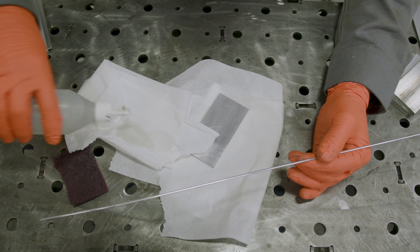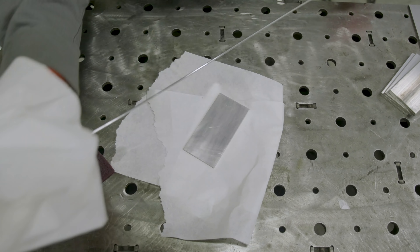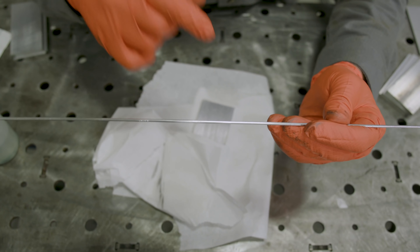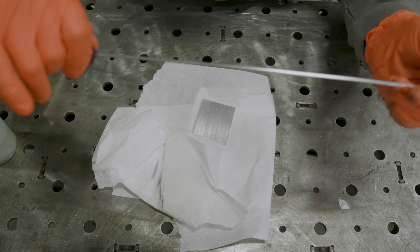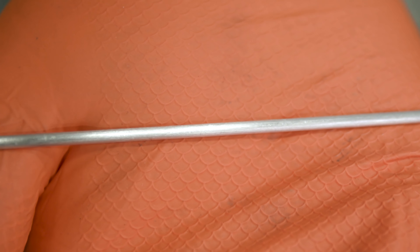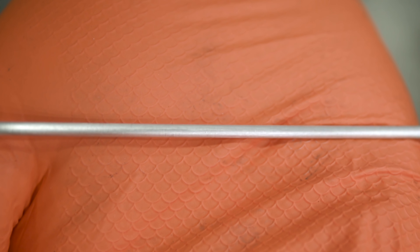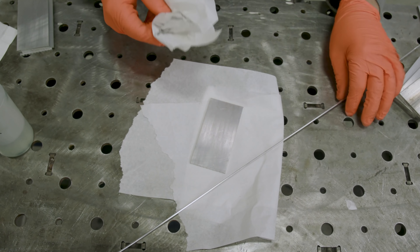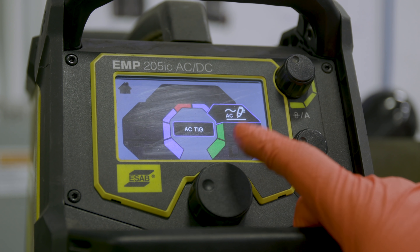If you want to pick up a box, Camera Guy is going to drop a link below. We're using 4043 three thirty-seconds filler wire. I do the same prep method as on my base metal — put some acetone on it. If you just do it once, just look at how bad it is. You've got an oxide layer on there. I never thought of that until Red Beer brought it to my attention — it's making me a better welder. All these little things make your weld look better. When you wire brush it, you can see it's not shiny anymore — it's dull. If it's shiny, it's a no-go, keep scratching. Then take a clean part of the rag and wipe it one more time — a little bit of dirt is still going to come off. That's how bad it is, and we've wiped it down four times now.